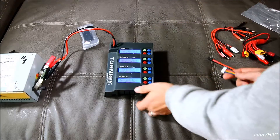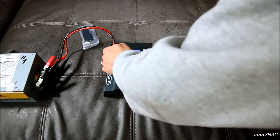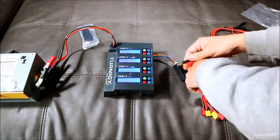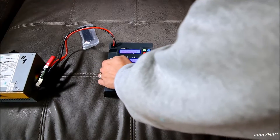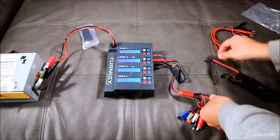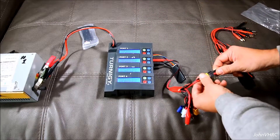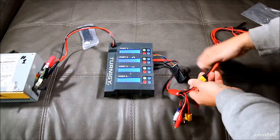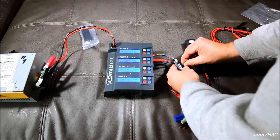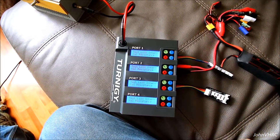This would be the balance end, and this other end plugs into here, which will go into the charger. Let's see what port we've got here — we'll just go right to port 1. Plug that in, and we'll plug in this. Now we'll plug in our battery. We've got one of the high-quality graphenes. Then we'll plug this end into the 3S port for the balancer, like such. Okay, we've got our battery plugged in, going through port 1.